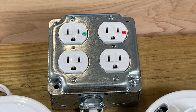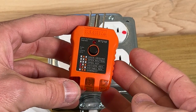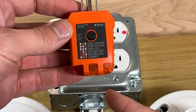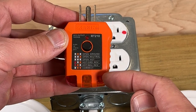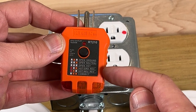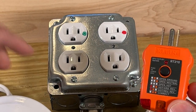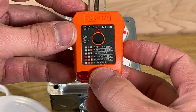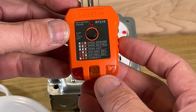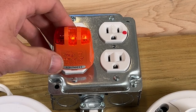Outlets are a little bit easier to identify if they're correctly wired or if they have the neutral and hot reversed, and that is with a simple outlet tester. This one is made by Klein Tools with three LEDs — pretty much all outlet testers have three LEDs. Depending on the combination of LEDs that are lit, that will tell you about the wiring on each outlet. For the correctly wired one, we'd expect those two orange lights to light up, and you see that is the case.